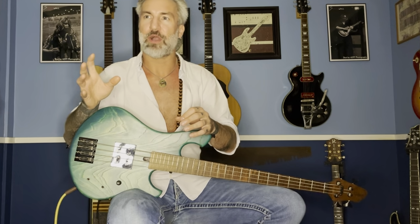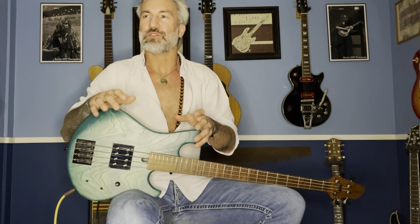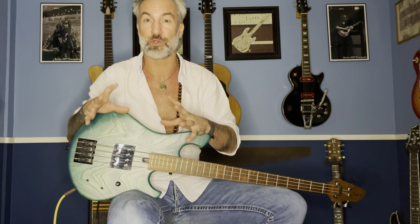And then I went low output. That was something that he was looking for, something that was lower output, and low output doesn't actually mean volume, it just means low wind, which gives you a cleaner tone. So it's lower output, and then the two coils are wound with different wire gauges. One coil with one wire gauge, the other coil with a different wire gauge. The same number of turns, it's still perfectly hum canceling. Both coils are always on, I'll get to that in a second. But it fattens the tone up, even though it's lower output, so that's really cool.